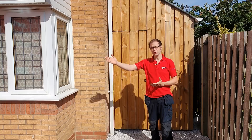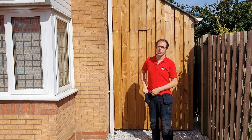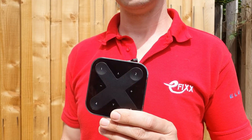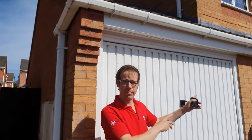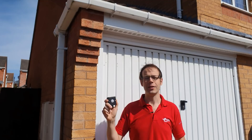I really want these to illuminate as someone approaches the house, but I also want override control so I can turn the lights on and off whenever I choose. So I'm going to use a motion detector mounted on the house itself to turn the lights on and off as people approach, and I'm also going to connect it to an override switch inside the house. Now the best place for this detector is actually on the other end of the building from where the lights have been fed from. Normally that would mean running cable from one end of the building to the other — but actually I can connect this motion detector to a completely different circuit and have it control my lights wirelessly.